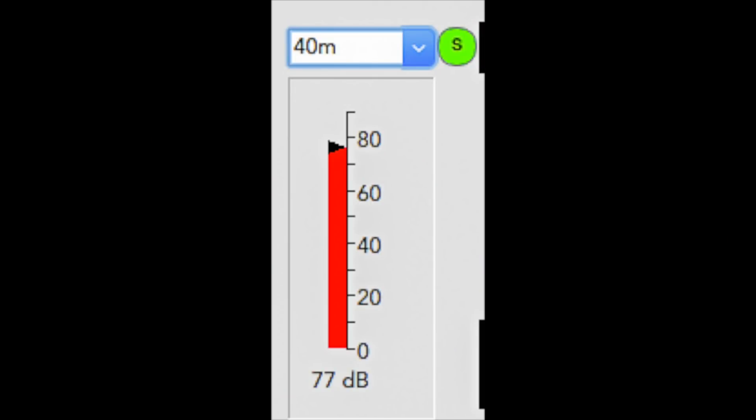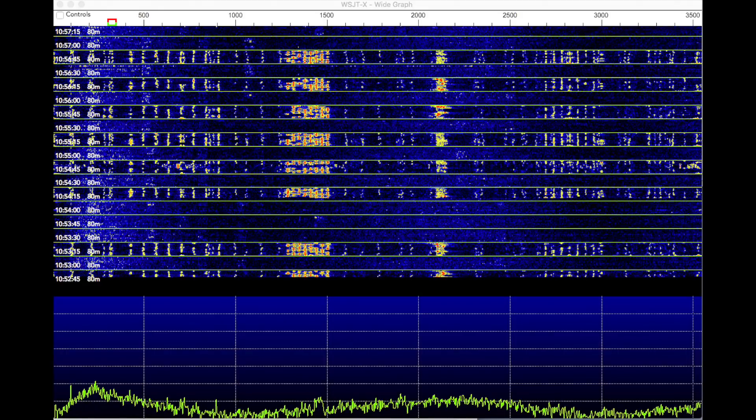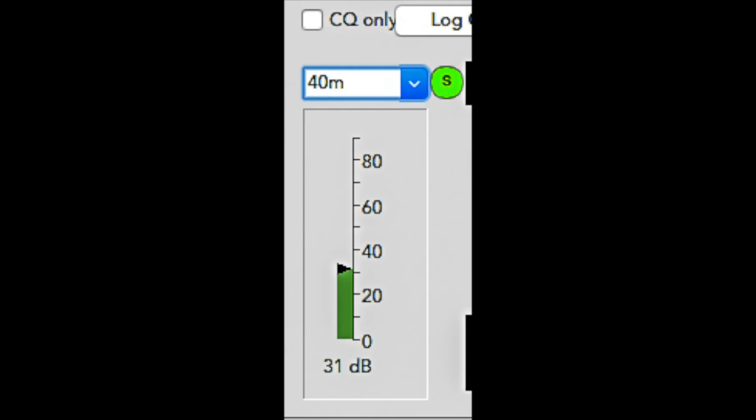When you have a band full of signals with a wide variety of signal strengths, I get good results if I ride the RF gain control. Continually adjusting the RF gain allows me to create the best opportunity to successfully decode signals of different strengths. When I first started out on FT8, I tended to have the RF gain way too high, thinking more was better. I quickly learned this was not the case — it can create problems when very strong signals are present, causing the computer's sound card to reproduce that signal in different parts of the waterfall. If you see a strong signal reproducing itself on the waterfall, don't assume it's the fault of the other guy's transmitter. There's a better than even chance your RF gain is too high. I've been amazed at just how low I can get the RF gain and still successfully decode signals across the band.